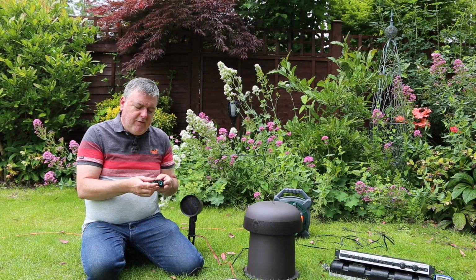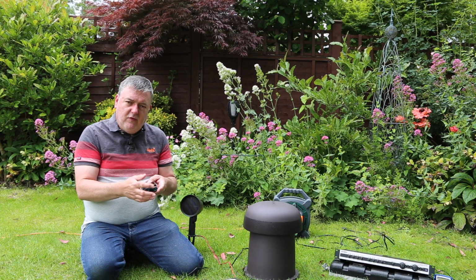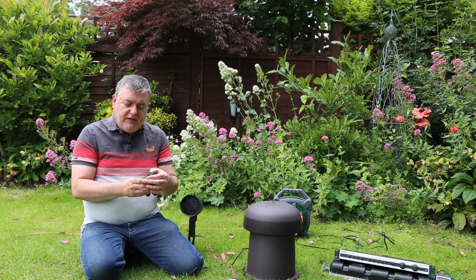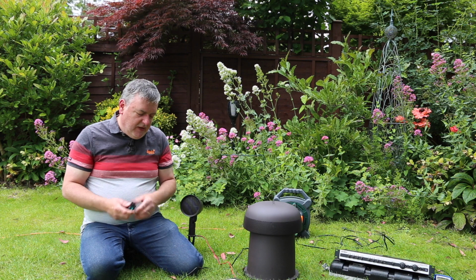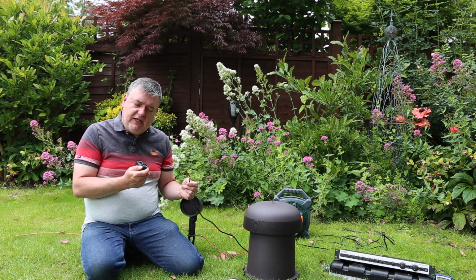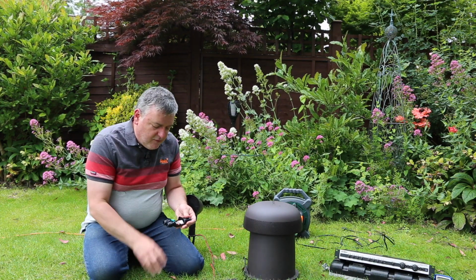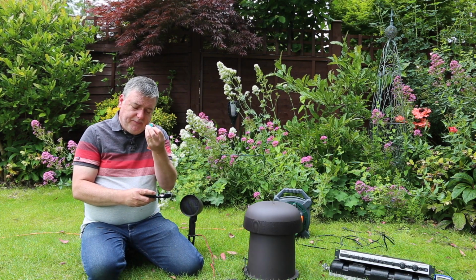First of all, there are three gland connections, one in and one out for your main cable, which is carrying the 4 cores of left and right. Then there's an output which can have a different gland according to the speaker you're connecting to it. So, if you're connecting a circular cable, you can use the small inner circular gland, and if you're using a shotgun cable, you can use one of the glands provided, which is designed for shotgun.